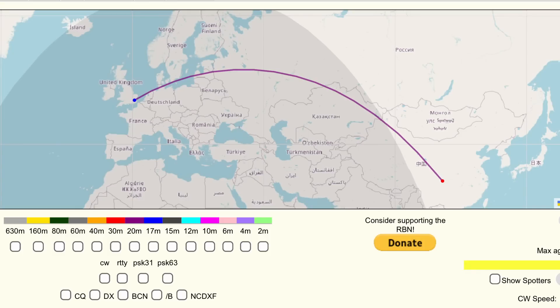I was on the QRP channel, 14.060, and I put out a test call just on midnight. I got a report back from China — 5 dB above noise. Eight watts on a dead band to China — quite amazing. I couldn't work him because it was just a reverse beacon station, but it proved two things: the vertical was working, and when the 20-meter band appears dead late at night, check it out — the band is not always dead, you just need somebody to call CQ.